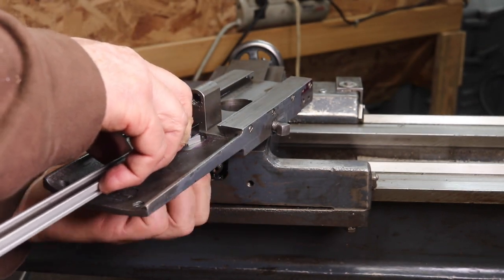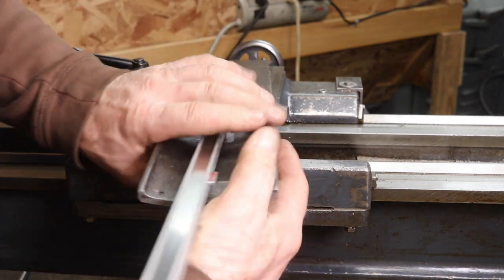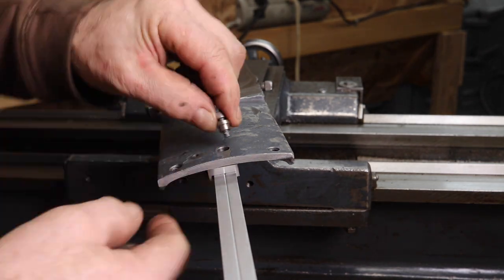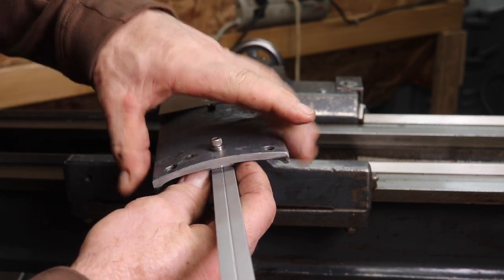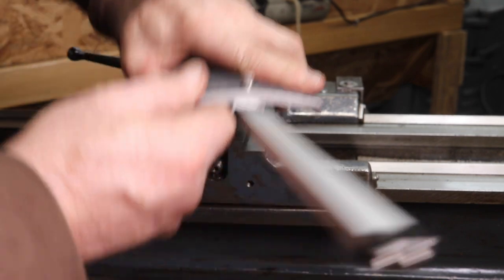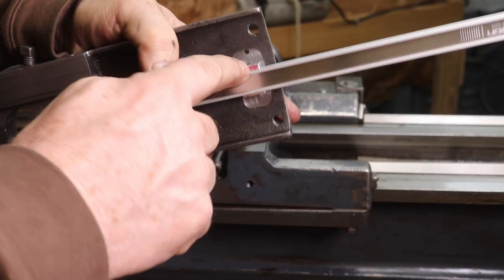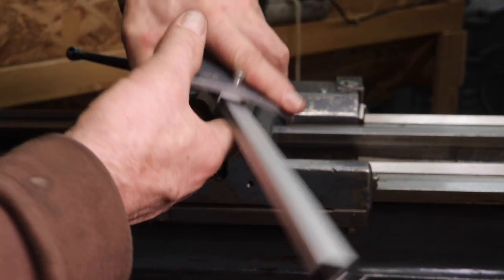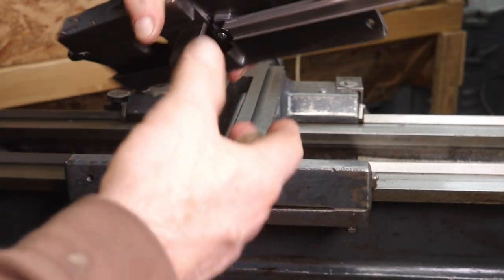I use metric hardware on this — some of the screws came with the kit for the scales, so some of the hardware is metric and some is imperial. On this side there was a small hole already from before, so I enlarged it to a 5/16 hole and made a special little bushing to center up in that hole. It gives a little movement. I built about 50 or 60 thousandths of side-to-side play into it for adjustment, and that's what the set screw is used for.